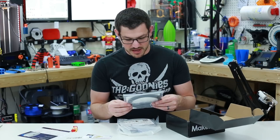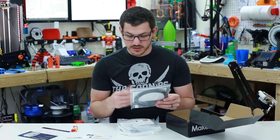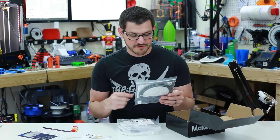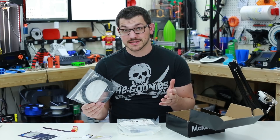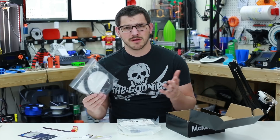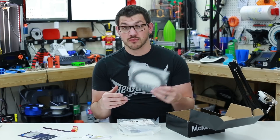Up first, Advanced Matte PLA by MatteForce, in a nice slate gray — a darker gray. Print settings: hot end 180–220°C, so normal PLA settings. Bed temperature room to 60°C, speed 40–120 mm/s. It's described as a premium quality PLA with a matte finish for higher quality visual prints. I previously used the matte filament from Proto Pasta and was not a fan — had a hard time printing with it. Maybe now with better skills I could do it, but we'll see how this one from MatteForce works out.